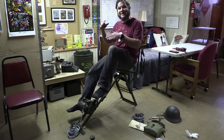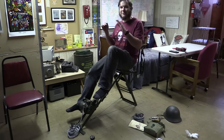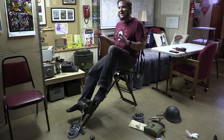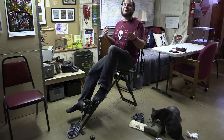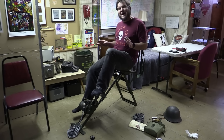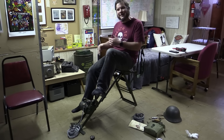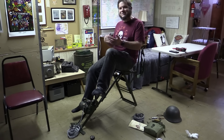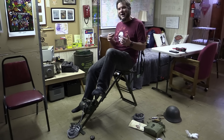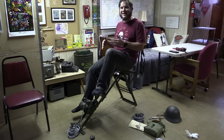You can see how hard it is to maintain an even voltage — that bulb is getting brighter and dimmer as my legs go around. So this is not really good for direct connection to a radio or any kind of sensitive electronics. It's fine for a battery because a battery doesn't super care if it's getting 13 volts, then 14, then 13 again. I'm not sure how good this would be for modern LiFePO4 battery chargers — those lithium iron phosphate packs might not appreciate having an inconsistent voltage, although solar panels can also have inconsistent voltages, usually not quite that quick — not multiple times per second like this would be.